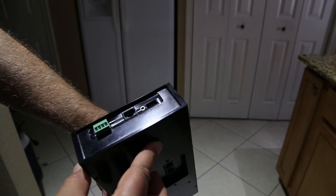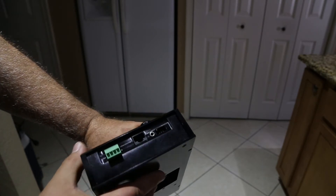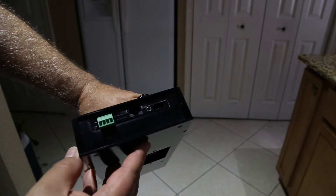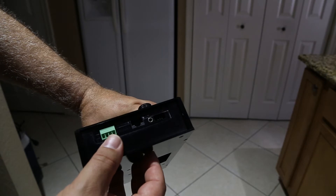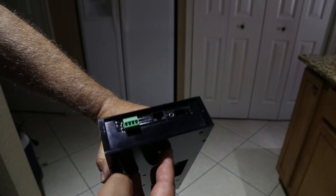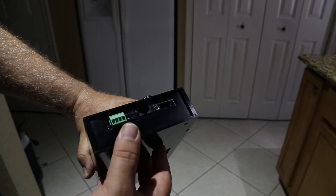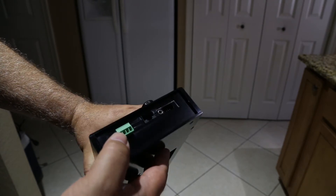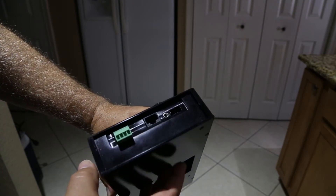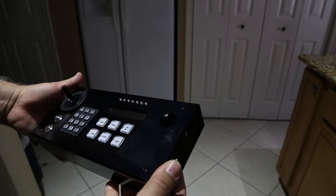This RJ45 is an RS485 port for communication to other equipment. I'm not sure exactly what I'll do with it yet, but I wanted to give it the ability to communicate to other gear, so that'll be useful in the future. Then there's a Phoenix connector with four positions: two of them are an isolated relay contact you can include in your program to turn the spindle on, control coolant, or whatever you want. The other two positions provide plus five volts and the collector of a transistor, which you can enable in your program — useful as a servo enable signal for something like ClearPath servo motors.